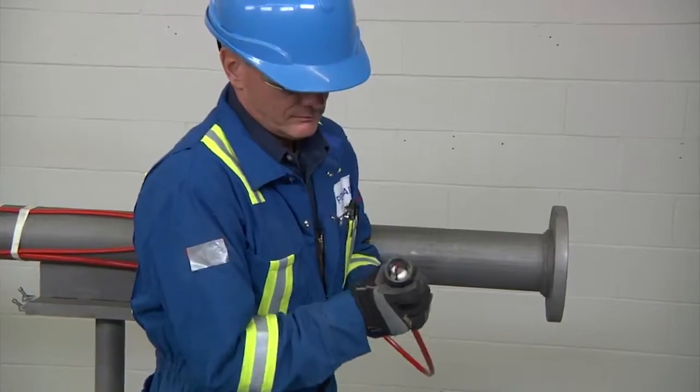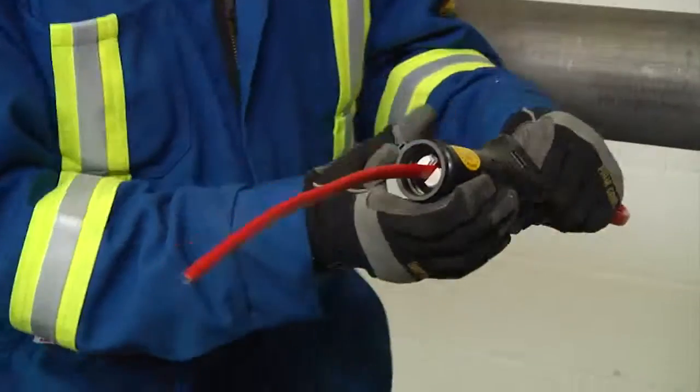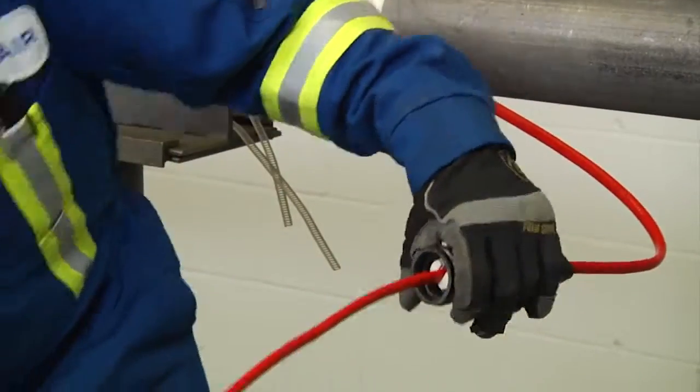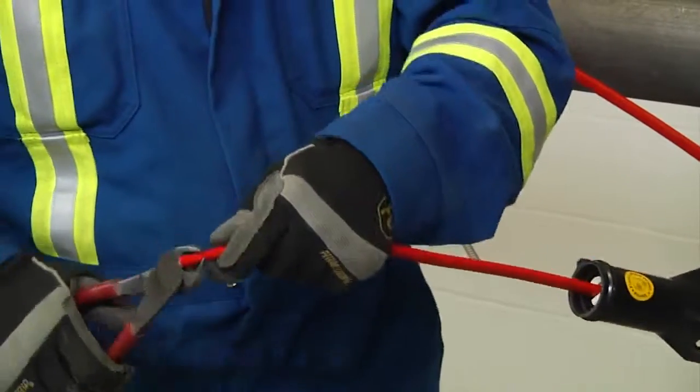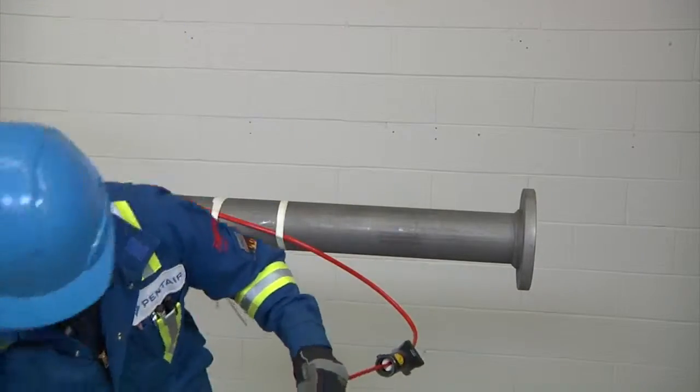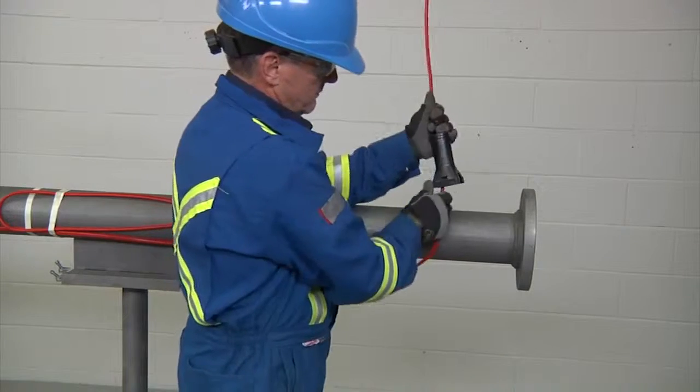Push 18 inches (450 millimeters) of heating cable through the stand. Now square off the cable end with a 90-degree cut, but do not attach to the pipe yet, and proceed to stripping the end of the cable.